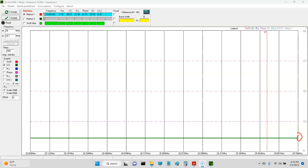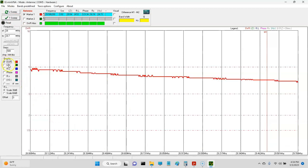Now let's go to the antenna — antennas are where things get really crazy, because now we have all these variables with coils, loading coils, and things of that nature. I've got my 50-foot feed line and my Charlie Papa 610. I'll do a sweep. That's bad — really, really bad. SWR at 28400 is almost 5. When I tested this yesterday transmitting at 28405, the SWR meter was going almost all the way to 5 and there was no power coming out of the radio. At 28400 the SWR is 4.41 and the impedance is at 12.